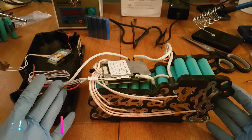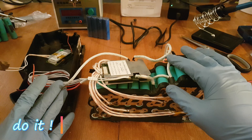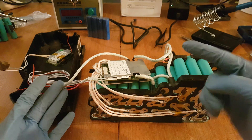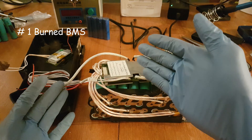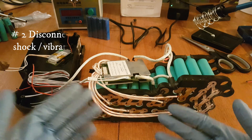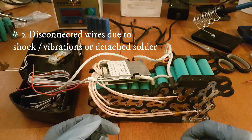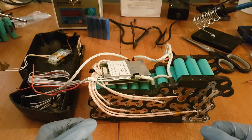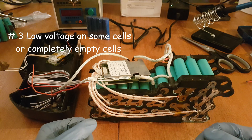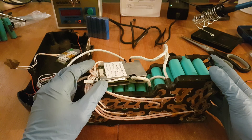In this video I will show you how to repair an e-bike battery. The most common reasons for a faulty battery are: number 1, the BMS has failed — in this situation the battery will not charge or discharge; number 2, some wires got disconnected or soldering got detached, which you can easily visualize; number 3, some cells release less voltage than normal or have died completely.